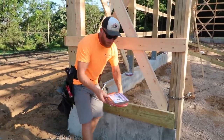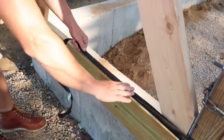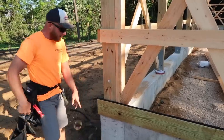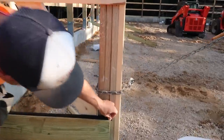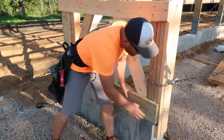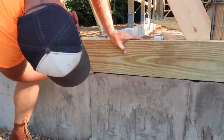It's non-corrosive, it's not going to hurt anything. We take this sealant tape and put it on the bottom of the grade board. The grade board is a little damp from morning condensation but this tape is pretty sticky. It's compressed in packaging but over time it starts to expand. What's nice about that is this concrete, while the contractor did a really good job, if you look here you can see gaps — this foam sealant will just expand and fill in all these cracks over time.